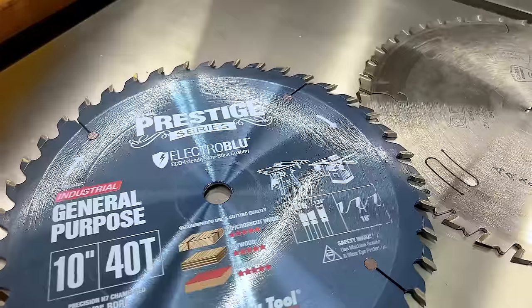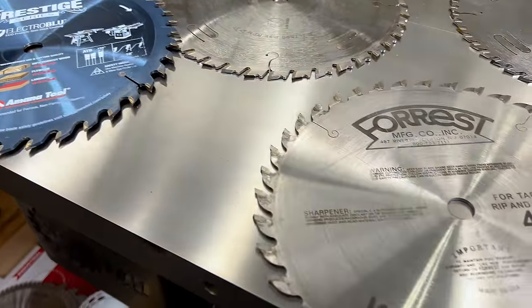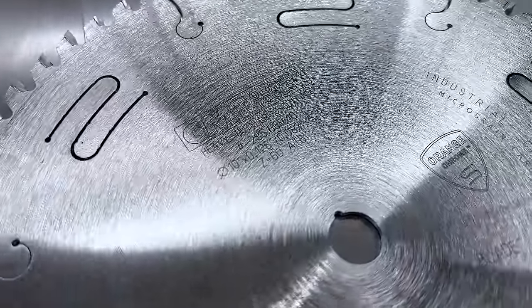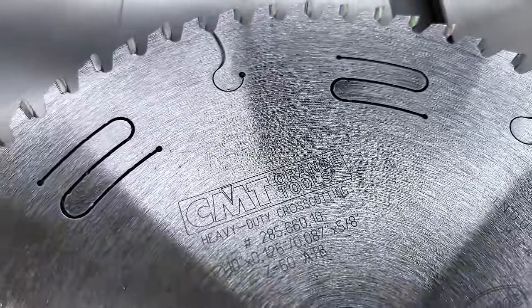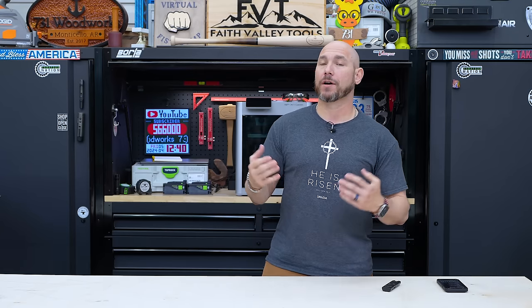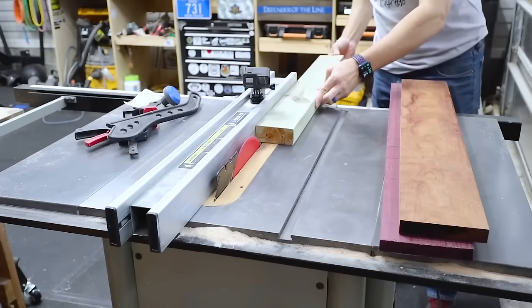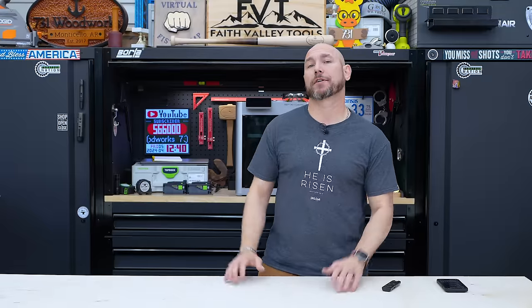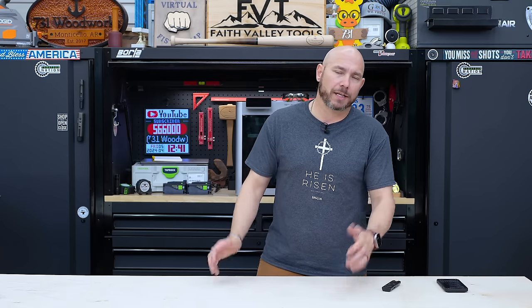Another upgrade I suggest is tool upgrades — not buying new tools, but replacing the stock blades that come on your tools. Even the SawStop comes with a very cheap blade. I like CMT Orange Chrome, especially for my table saw — I run a 50-tooth combination blade most of the time. They're not overly cheap but you get what you pay for. I also like the Diablo line because they're a very good value. I used them for years on my miter saw and table saw with no issues. If you're on a budget, look at Diablo. For top-tier, buy-once-cry-once blades, look at Ridge Carbide or Forrest — though I'm more a fan of Ridge Carbide. The CMTs do last quite a bit longer, which is why I gravitate toward those.